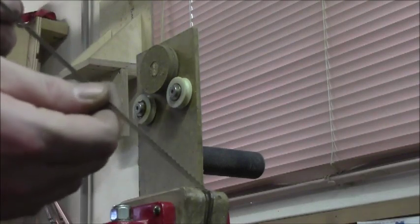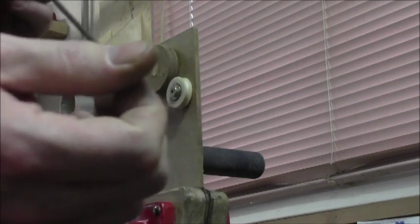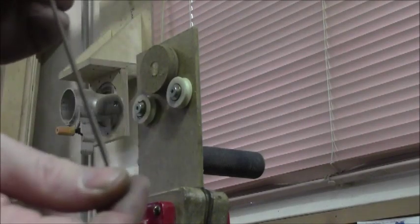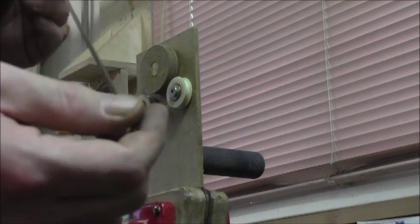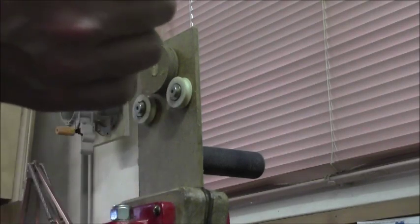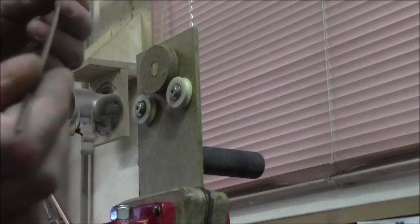What we're going to do is take our fret wire — this is wide, high fret wire from StewMac, jumbo fret wire, the pretty much the highest profile you can get. This will allow for a lot of fret levelings down the road, probably two or three depending on how deep the wear is on the frets. I always tend to use the deepest stuff I can.